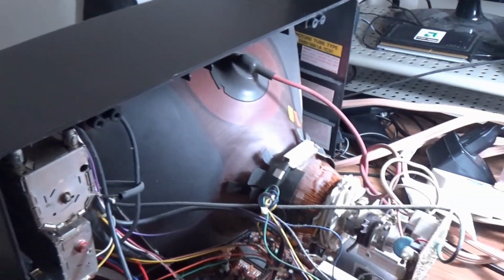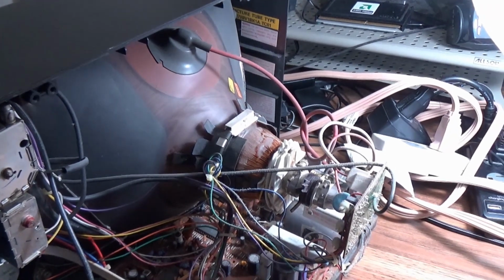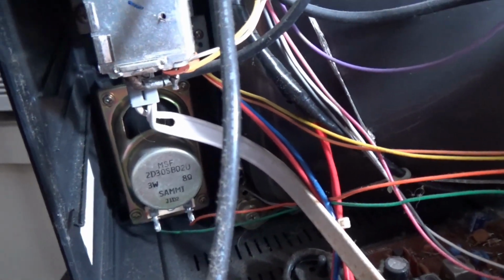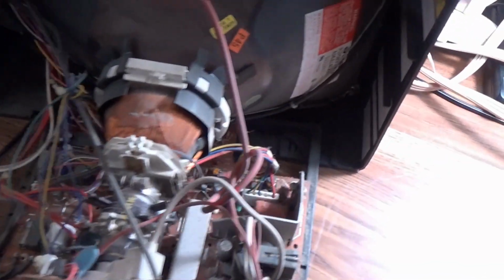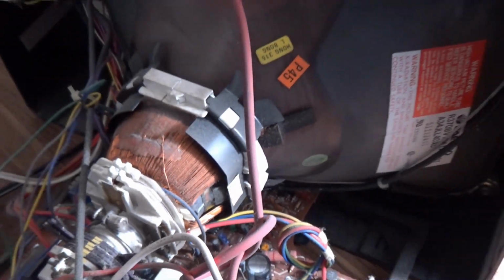Like that high voltage suction cup over there. I don't know. Maybe CRTs are a technology that we should just let die. Or, better yet, do what everybody's doing, run them into the ground. The potentiometer, though, to get it not so scratchy, is right over there by the speaker. That might be a lot more safe than this other stuff here. I don't know. I really don't. Yeah, I'm not proceeding with this. This is too awkward and too dangerous for only one person to do. That underneath the tube, that orange thing with the Phillips head thing there, that's the horizontal hold potentiometer right underneath the freaking tube.